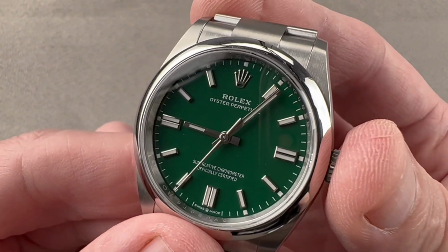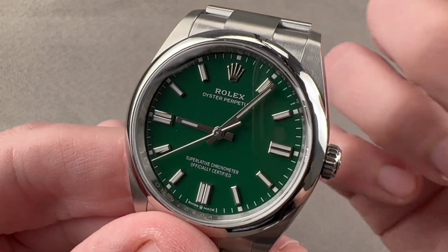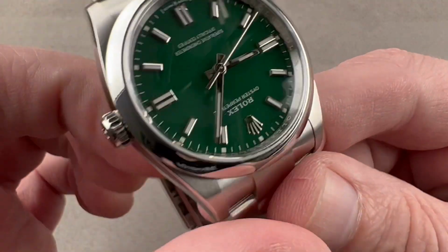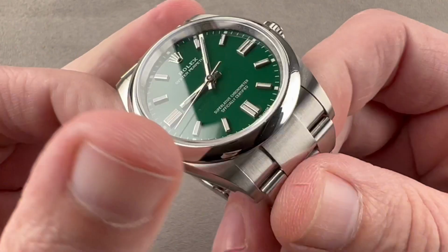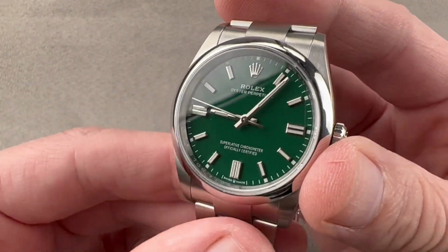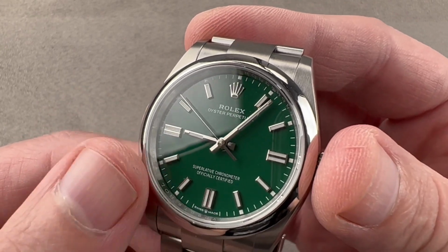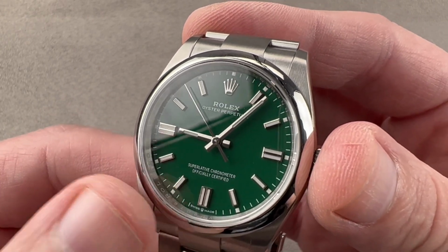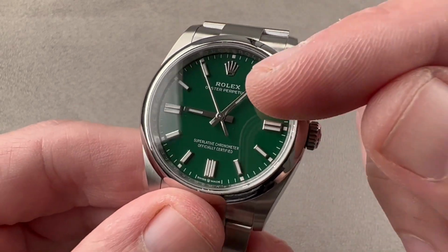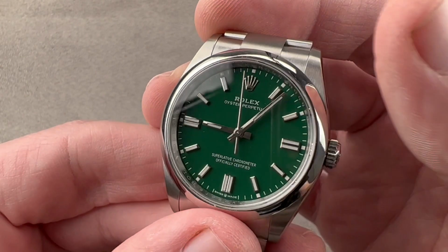We have an overcoil hairspring made of blue oxidized niobium zirconium. It is a highly anti-magnetic alloy, and the overcoil helps the watch pass the chronometer test, which involves testing in 5 physical positions. Rolex then cases up the chronometer certified movement and tests in 6 positions as a fully assembled watch, and it has to keep time no worse than -2/+2 seconds per day. That is the basis for this term superlative chronometer in the modern era, far beyond the COSC requirements.